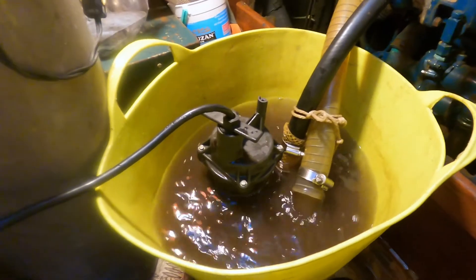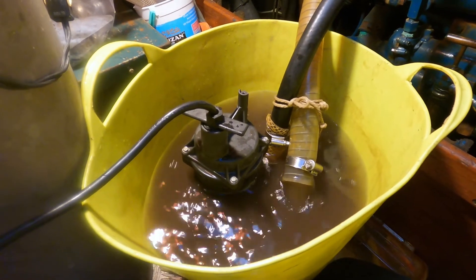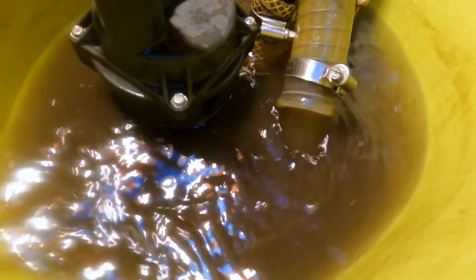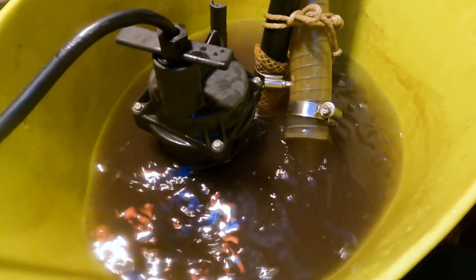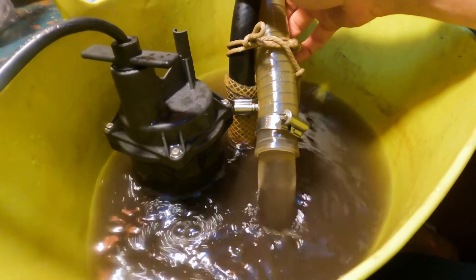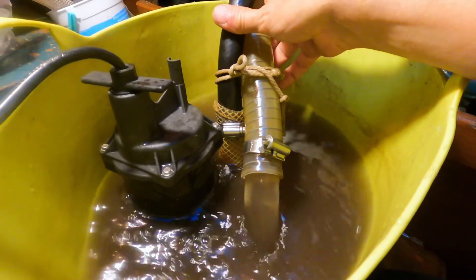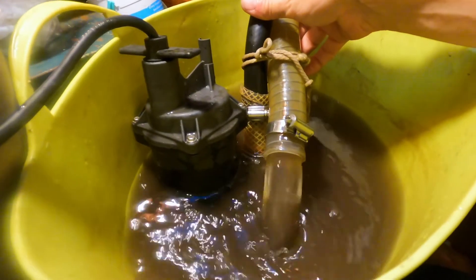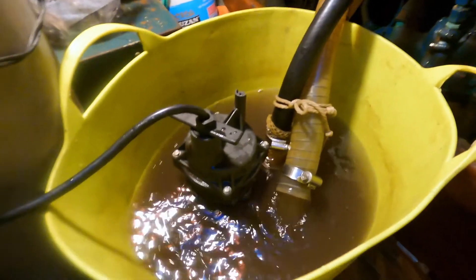This is now the third bucket of just flushing after the first flush in between of water. So a lot's been flushed. It's getting clearer — you can see through it. It's still pretty dirty, but with all the crud that came out and pieces of impeller, now I'm getting a huge water flow. The whole pipe was just blowing up. The first couple times I ran this, it was so slow the water was just drizzling — almost dripping — making the pump overheat. So I would say this was a successful flush. Now I get to put my plumbing back together and this job's all done.